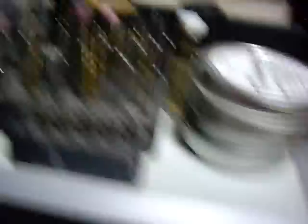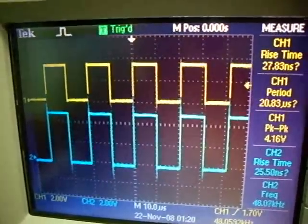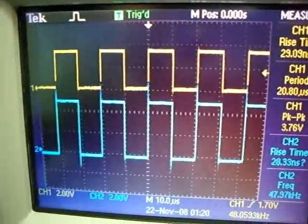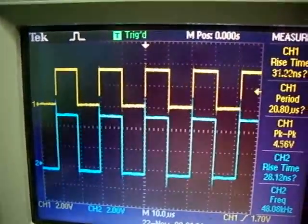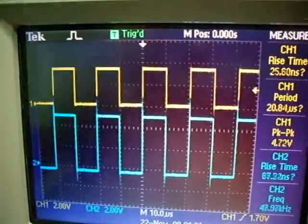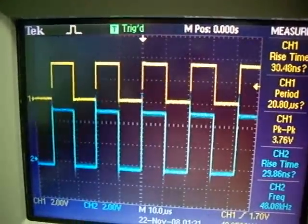What we do now is use the amplitude and rig it up even more — see what happens to the yellow signal. We're turning up the voltage of the input signal, and the yellow signal is still fine. It doesn't vary, it doesn't grow beyond unsafe levels. It does grow a little bit, but it's always within safe limits.